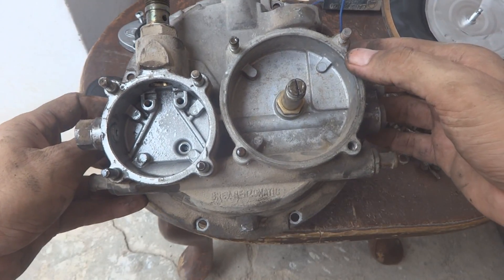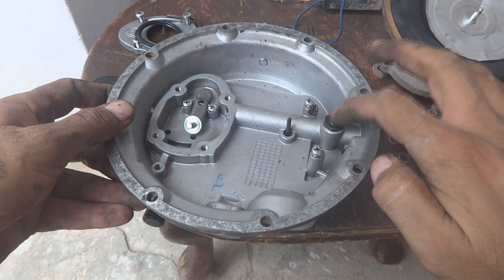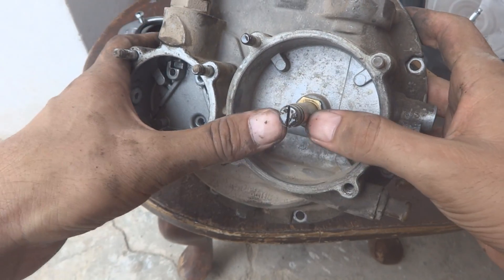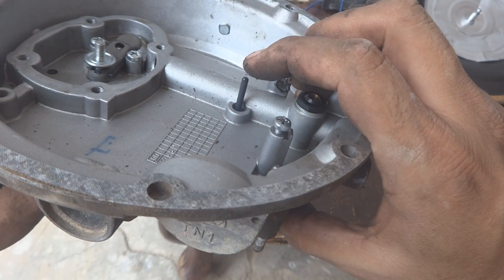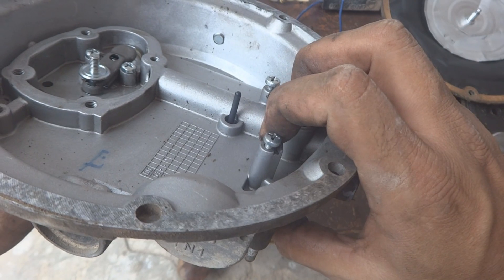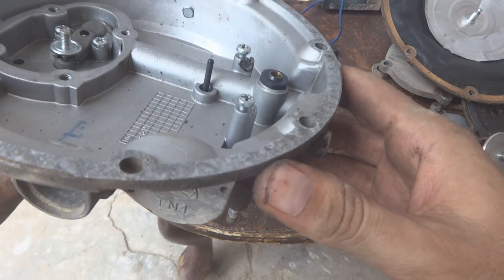Here also you can see this adjustment coming to the main gas. There is a plunger inside — this is the plunger part. While we are switching on, this plunger extends, and while we are removing power, using spring force it comes back and the gas is stopped from going to the engine. That is the function.